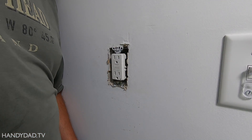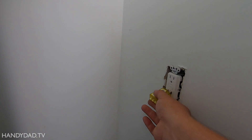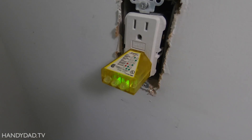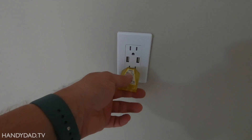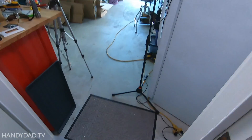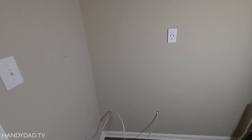All right, let's turn on the breaker — it was this breaker here. I take my little tester and I have two green lights. That indicates it's wired correctly. This one has two greens as well, and I'm assuming that one will too. Well, I know this doesn't look really good for now, but it'll eventually have cabinets here, and they'll cover that up. That's the next step — eventually.